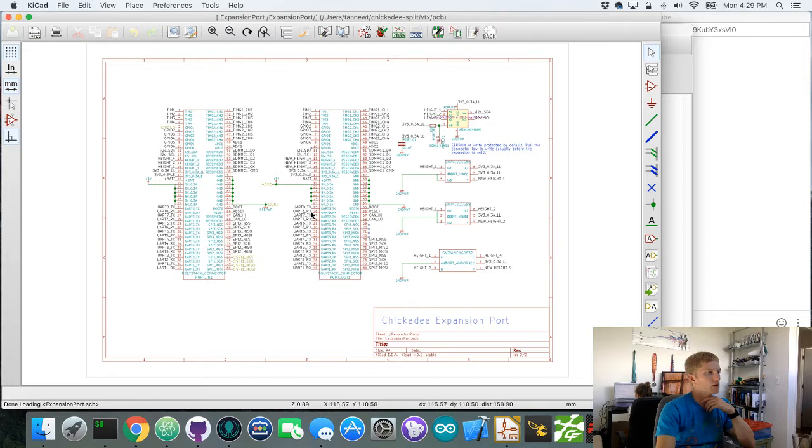It's got both the bottom and the top connector, and I think in this case, we're actually going to omit the top connector because, for one, the module is too high. It's very tall, and two, it's going to probably generate a lot of heat. So I want to experiment with having this always be a top board. It's not something you should do very often because you lose a lot of flexibility. Like, that top spot must be occupied by the VTX then. But I want to see how it works. So that's what we're going to do.